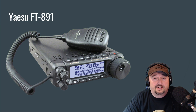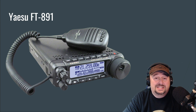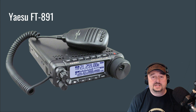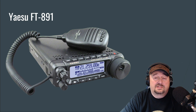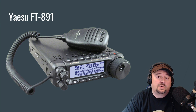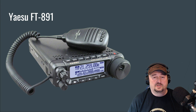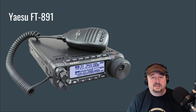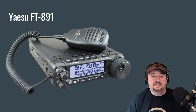The FT-891 doesn't have a waterfall or color screen waterfall like you see on some other radios. It doesn't have a sound card, so getting audio in and out for digital modes — which are very popular with beginners — is going to be a challenge requiring an external sound card interface solution. It is 100 watts, which is awesome. The head unit display comes off, giving you options in terms of mounting choices. It covers 160 meters to 6 meters, so no VHF or UHF shack-in-a-box capability. Yaesu is a fantastic company with good vendor support — that's why it's in the top five, but not at the top.